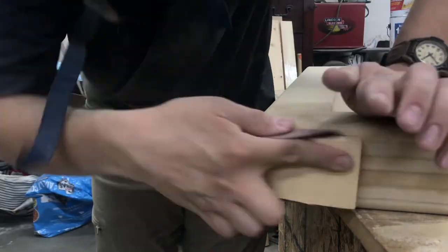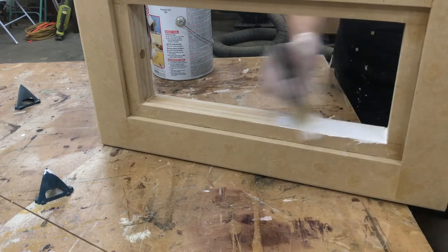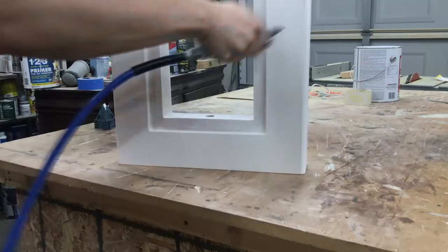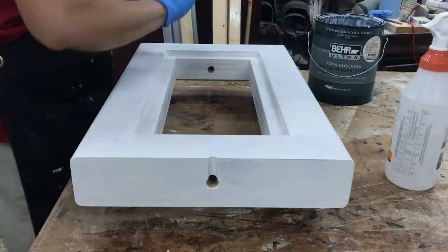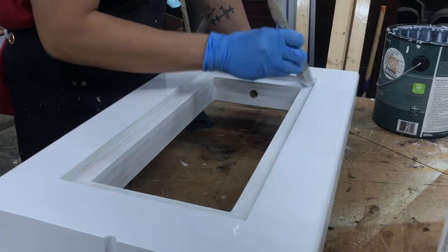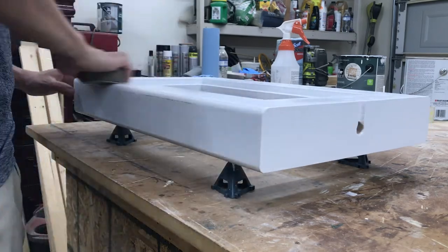I hand sanded the freshly cut edges with 220 grit sandpaper, blew off the dust, and proceeded to prime the entire base with shellac base primer. This is the same primer I've used on my previous laminate furniture makeover projects — it works great for bare wood as well. After that dried, I lightly sanded it smooth again, cleaned off the dust with compressed air and a damp rag, and proceeded to add the top coat. I used the water bottle mist method where I lightly mist the brush and the surface with water to help achieve a smoother finish. I used some leftover regular white paint — this lamp is just a proof of concept so the paint type didn't really matter. I lightly sanded the entire thing again, wiped away the dust, then added the second coat of paint.